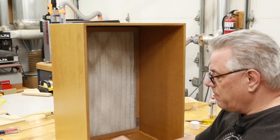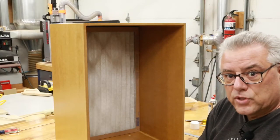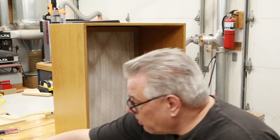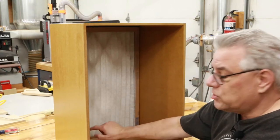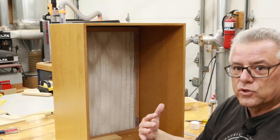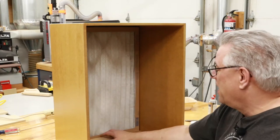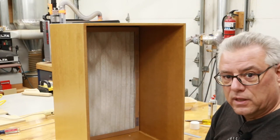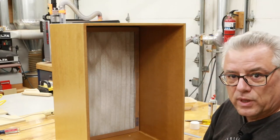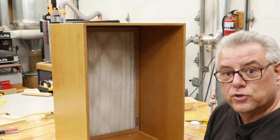So what I decided to do, I came up with the idea that I could use a couple of neodymium magnets inside the walls of the paint booth, and then on a mating piece have a matching neodymium magnet. And then that way you could take that cleat or that block, angle, whatever I come up with for it, to hold against the filters. We don't really need to hold them from coming this way other than just the slightest effect of it falling down. I mean, there's nothing to force them out at you. They get sucked in when the booth is in operation. So I don't need a super secure means of holding the filters in. But these magnet systems are really nice because you can just grab a hold of whatever it is, slide it out, pop in the new filter, slide the new one in, no tools, no fuss, no muss.